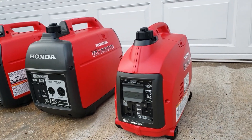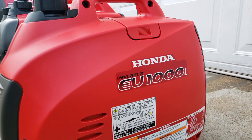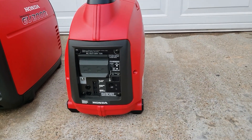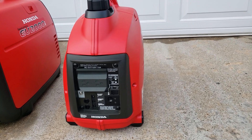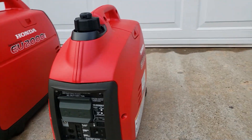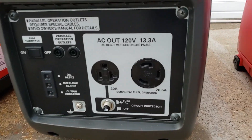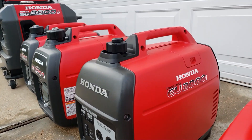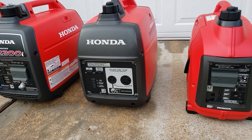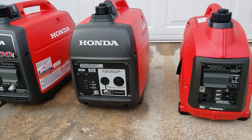Let's start from the bottom. The Honda EU1000 is perfect for camping and tailgating — real easy to carry, great for hitting the trails and overnight camping. It has a 7.5 amp output. Then you get the 2000 watt generator in the companion version, which has a 30 amp output, 2000 watts. You move up to this one if you have a small trailer or camper and want to power some heavier loads at 15 amps and up.